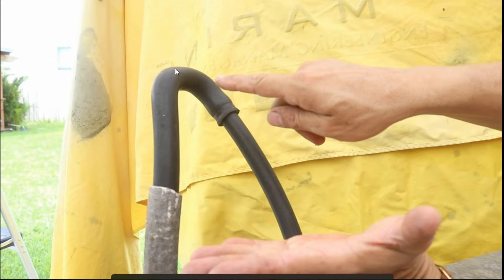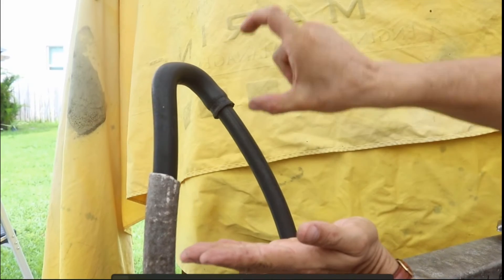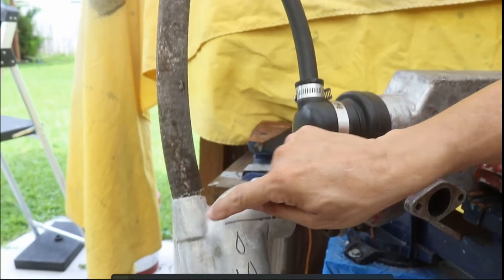This is the anti-siphon device. At the bottom is the water line. If the engine is located below the water line, this elbow should be extended over the water line a minimum of 12 inches according to ABYC. After that, the salt water enters into the elbow of the exhaust, exactly 12 inches over the water line.